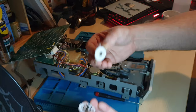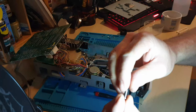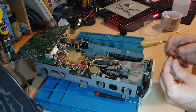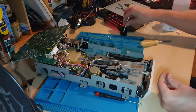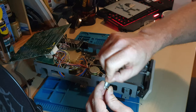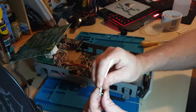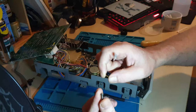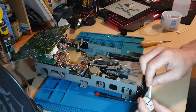There's a lot of muck and dirt coming off that — it's all sticky. I'm going to give that a clean with some IPA. The muck coming off that center pin was stopping it from running freely. Absolutely filthy is that pin. That should be even better now. This is the part that actually comes down on the disc and holds it as it spins around.